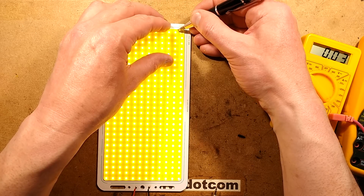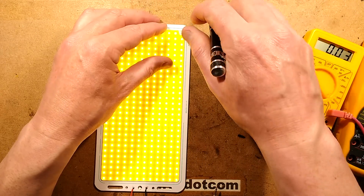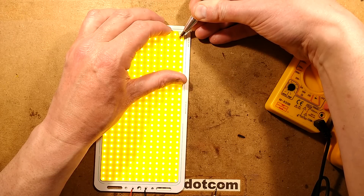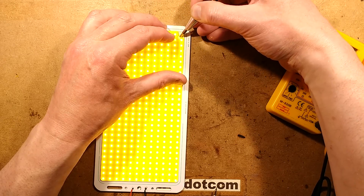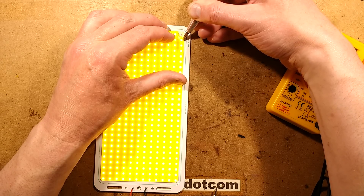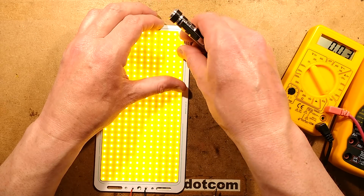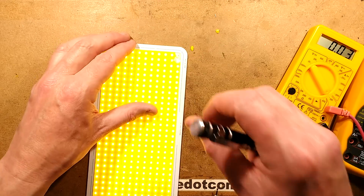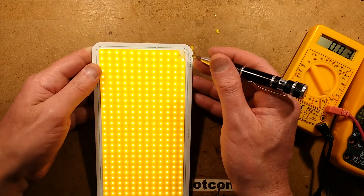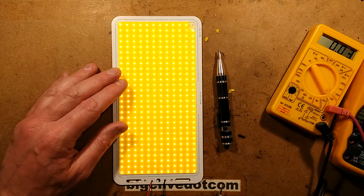I didn't expect that construction. The loss of one LED is not going to be a big issue. If it goes short circuit it will probably pop that LED from the current through the other circuit — so there's a sort of built-in redundancy. There's also a little dam here which is a soft silicone rubber, and then they filled the gel in. I can see the blue chip sitting under there under a thin layer of phosphor. It's a very smart panel, well worth playing with. Running it at a low current like 2 amps as a general ambient light — this is a very neat panel indeed.